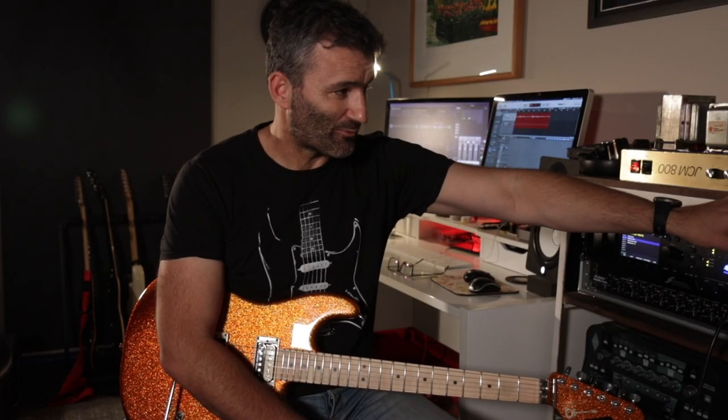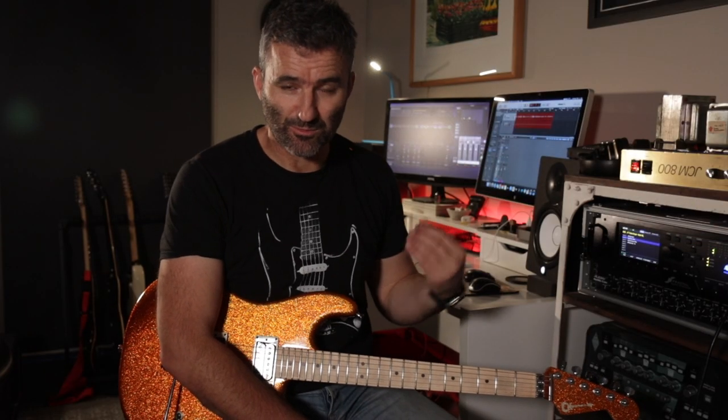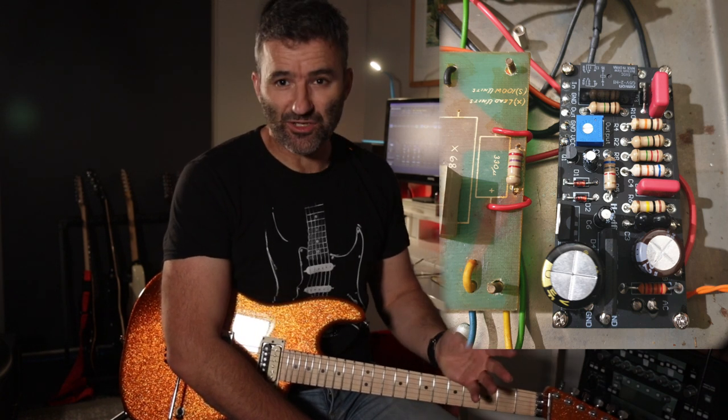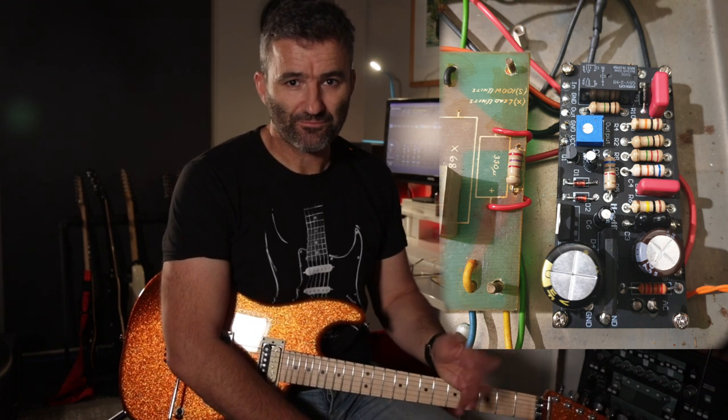So it's obviously selectable with the front panel, but it's also foot switchable. So it's relay controlled inside the amp. This is our front end high voltage FET boost. I've featured it on a range of other videos. It's a high voltage gain stage using a MOSFET transistor. So that's kind of foot switchable at the front of the amp and adds a ton of gain to the dirty channel. This is now a two channel amp, which takes us to the second mini switch here.